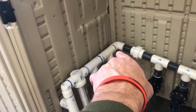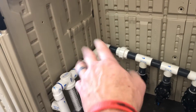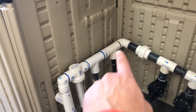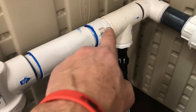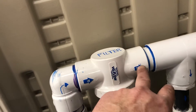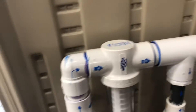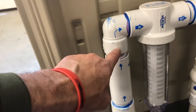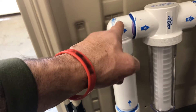I had a two-inch coupler nipple piece over here, but I had the extra space to put one of the bigger four-inch ones here and move that one over. That brought it in just a little bit. Then I switched around a couple of things so I ended up not needing an extra one of these down here — one less piece plus the connection, and that brought it in further. I figured out the exact distance I could get all the way in there, plus have enough of a gap to saw it if I ever had to. Then, as I was actually putting it together, I realized this piece has an insert so it stuck out even a little bit further. This is a street elbow, so I was able to bring it in and make it even shorter.